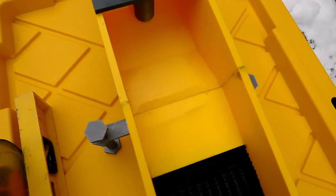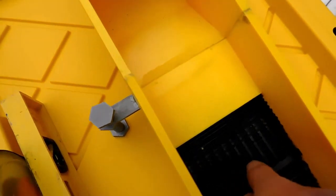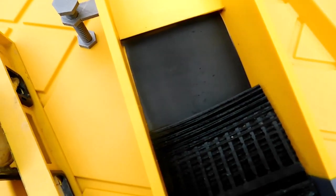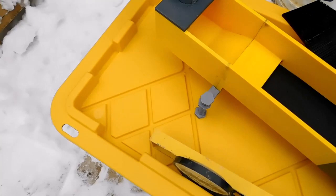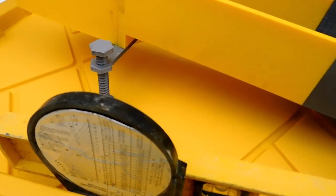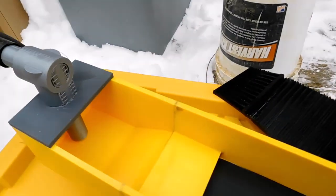If you haven't seen his wood sluices and deep well Miller tables, check it out — I'm sure he'll appreciate it. The mat slides right underneath a lip up in there, so it comes directly across right onto the lip. For the Miller table part, pull the mat out — and this is chalkboard paint. You can see a lot of the little printer grooves in there, which I think will work great for the Miller table. Then there's a flare — we went from four inches to five and a half inches with a flare at the bottom. Most cleanup sluices are kind of lame — you've got a small piece of aluminum you set in your sluice box. So I made this with levelers that screw up and down, front and back, side to side, so you can level it up.